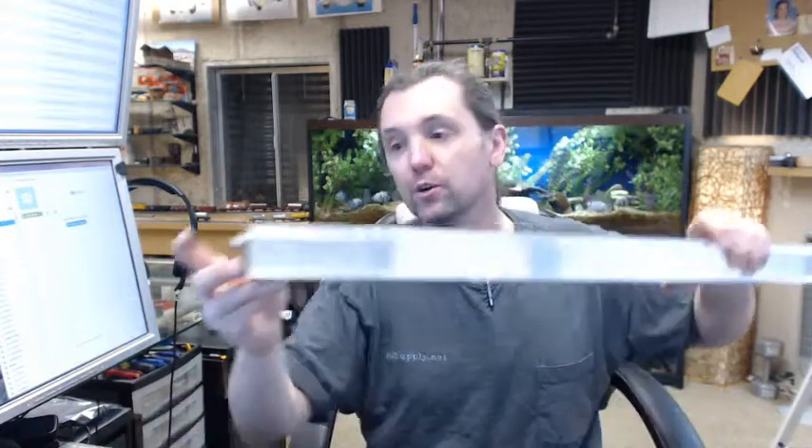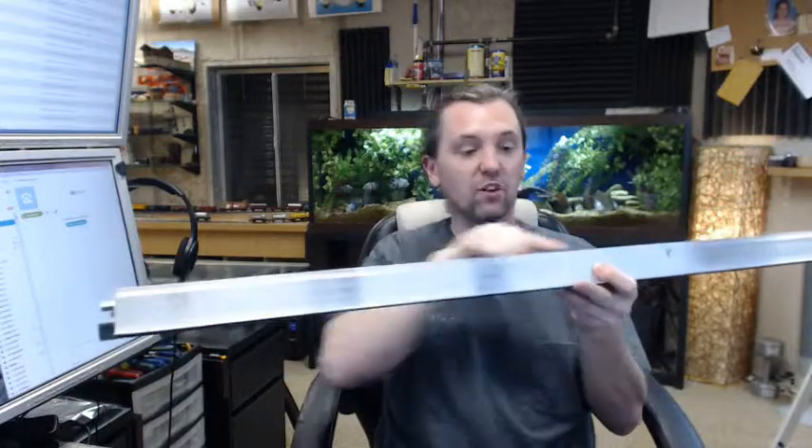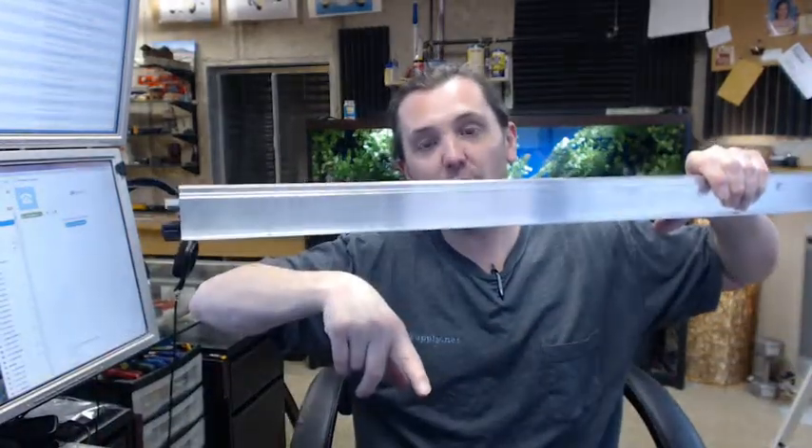Warning at the bottom of the page: care must be taken not to overstress the sealing bar and cause internal damage. What that means is as you are testing it, do not have so much turned out that it is putting undue pressure on the sealing bar when it drops, because when you open the door you want the sealing bar to snap back up into the housing. How that works is the plunger is connected to a flat spring — there is evidence of it by this screw here at the other end. When the flat spring is compressed by the plunger being pushed in, it can only belly, and as it bellies it forces the sealing bar to drop down. Too much pressure will damage the unit when you open it — that is why that warning is so critical.